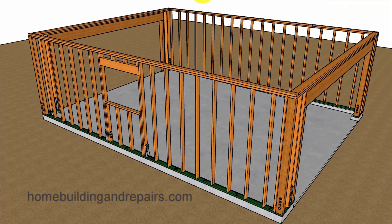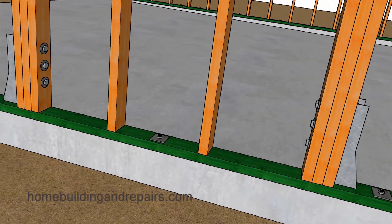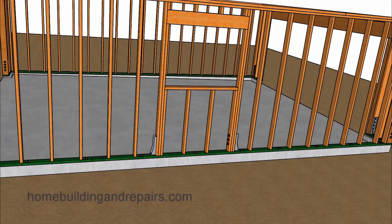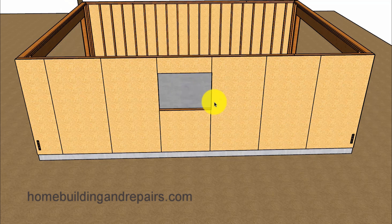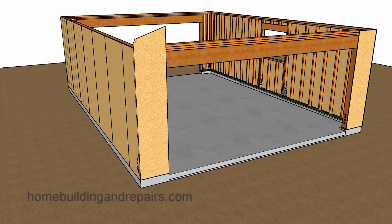Next, let's take a look at the hold downs in the window framing. The bolts that hold everything together might only need to drill through two of these studs. Your engineer will love the fact that I have placed a four-foot wide window perfectly so that the shear panel will meet at the trimmers or the framing studs. This isn't something you have to do — it's just an option, along with shaping the top of the shear panel instead of leaving it flat.